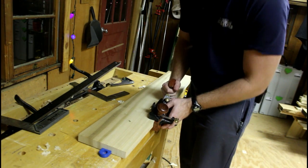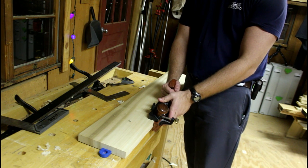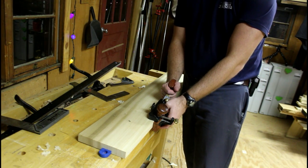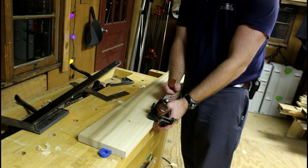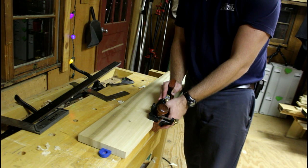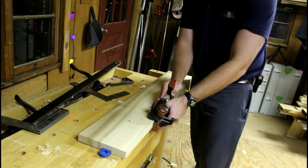With the small stock fence you kind of waddle a little bit because it doesn't have a lot of surface area to grab onto. With this auxiliary fence there's a lot more surface area and it usually comes down below the board, so you've got a real nice flat area to push against as you move the plane. This plane is all about technique and not a whole lot about how much you can take off at a time.